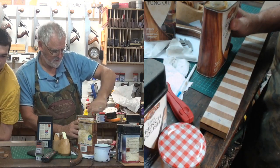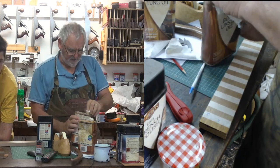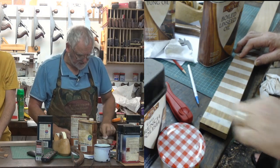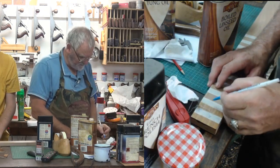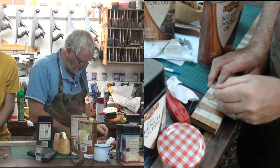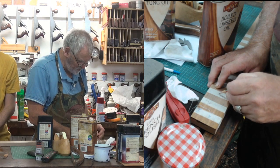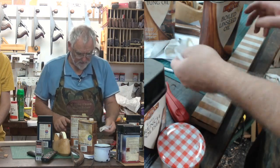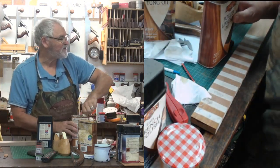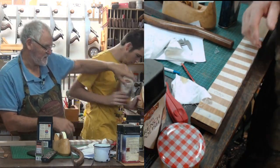Sharp tools, unless you carve it wet. Yeah, well, I shared that the other day. This is boiled linseed. That cedar is a very soft timber, but if you use kerosene, it swells the fibres up, and it's easier to work, which is an old wood carver's trick. Okay, that's boiled. Actually, can you just put these back over there when I finish with them? What, up on the top shelf? Yeah, if you can.